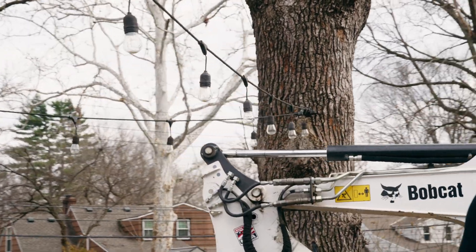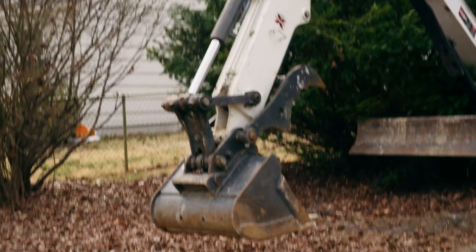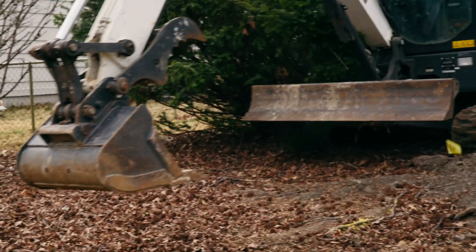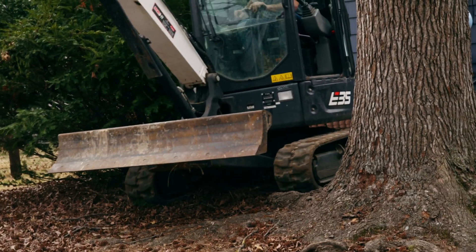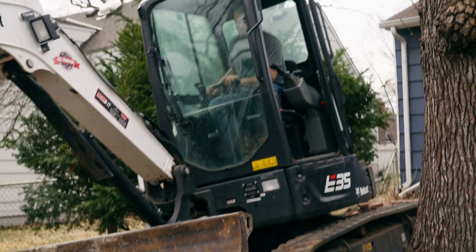Can you fit? No, you can't. Go that way. If you park this machine on gravel and do a 360-degree turn, you'll throw a track. Gravel gets up underneath the tee, knocks it off a little, and it throws a track so fast.